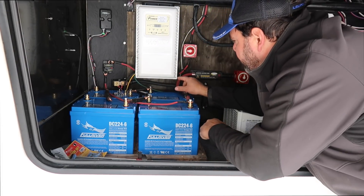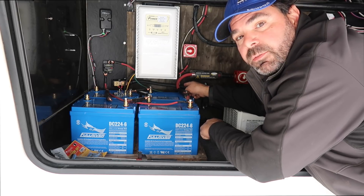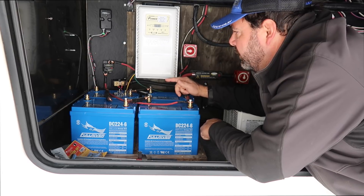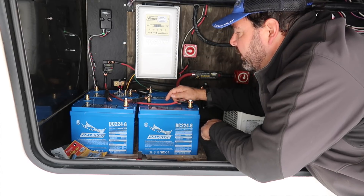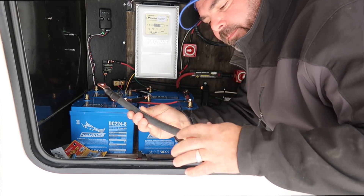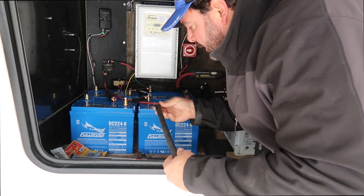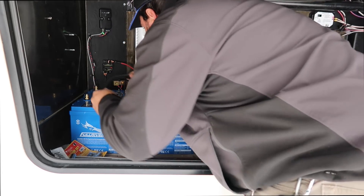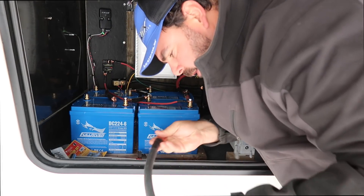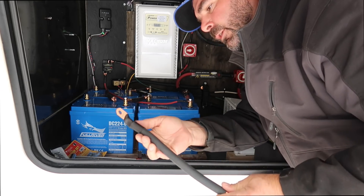I have a battery cable that I made for down here that was just too short. I wonder if that pre-made battery cable that I already made will fit right here — that would be great. I am going to go check that out. Alright, here is my new length of cable — I haven't crimped or finished this end yet, I just wanted to measure it and see what length I do need to make sure this is the right length. That length will be just perfect, so now I am just going to go crimp this end and put a heat shrink on there too.